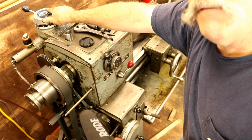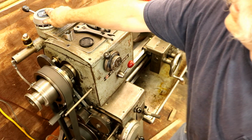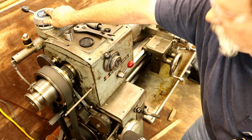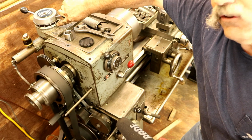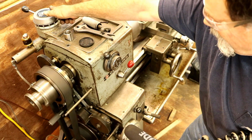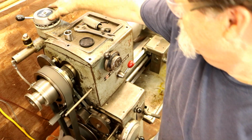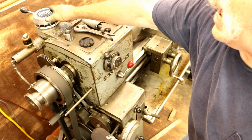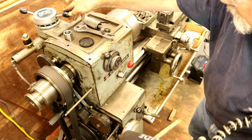Now we're only running about 35 hertz on it right there, so about half speed. At the 600 setting, it's 628 RPM spindle speed right there. And actually, my little dial here says 600, about that. Go 60 cycles. Now it's 600 here, and now I'm showing 1,066 RPM.